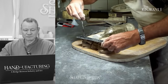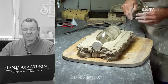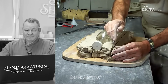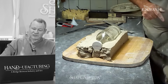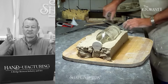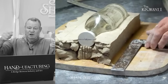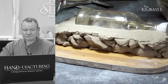All right, enough stories. Let's get back to the mold. So he's basically, you see he's getting ready to trim away a lot of this clay. In my mind, I wouldn't have built that much clay, but it's fast. And you want to use a cutting motion versus a chopping motion. Now he likes an angle like this. I never did. I thought it didn't give a good compression. I used to make vertical walls and I would drag a square across there to tighten them up. But he has a slightly different technique.